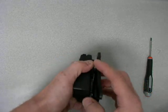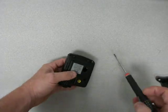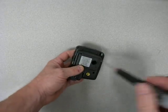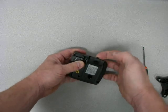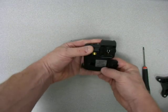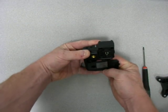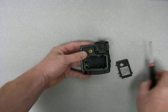To disassemble the Flex TT5, I have drilled a hole in the case here. But alternatively, you can open the battery door, stick your finger in fairly deeply, pop the door up slightly, catch it with your finger, close the door and it pops off.